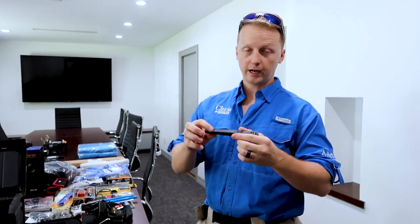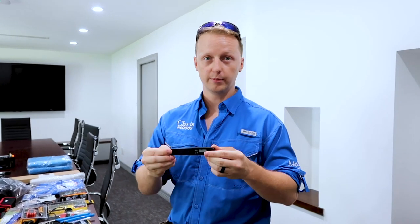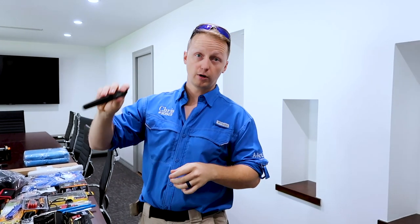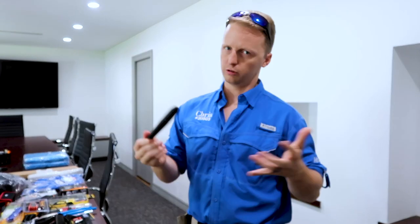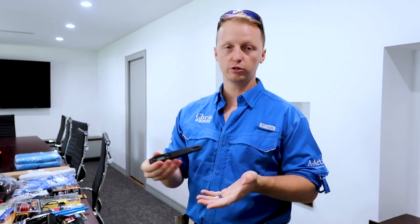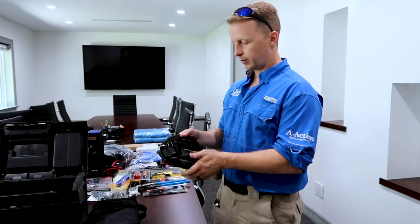The next item I like to carry is this digital thermometer. If you have an AC unit that's not performing very well, this is another way you can document the findings. You can put the thermometer in the return and take a picture of it, and you can also put it in the ductwork in the attic area. If an HVAC company comes in behind you and it shows 15 or 16 degrees difference, they'll know you weren't an idiot — and you can prove it wasn't working the day you were there.